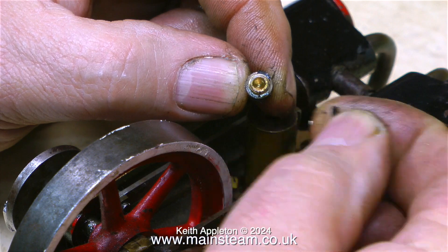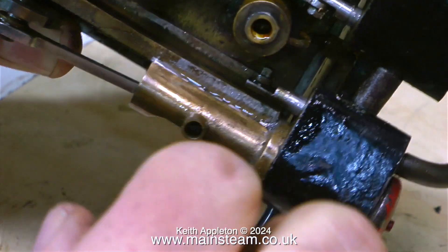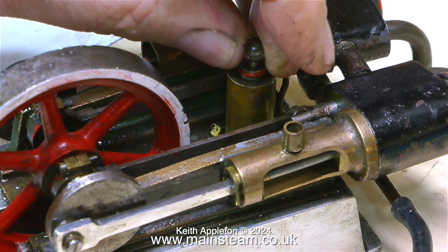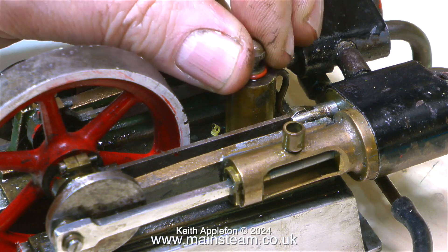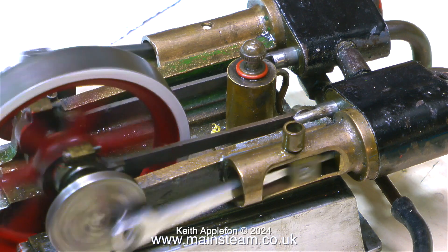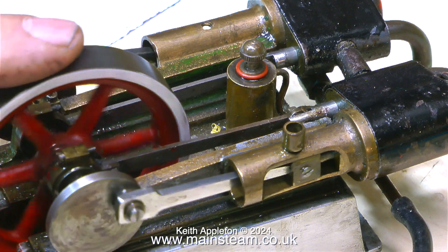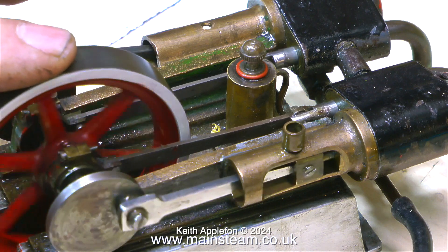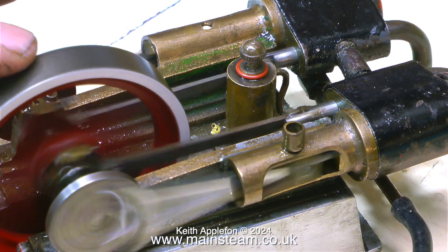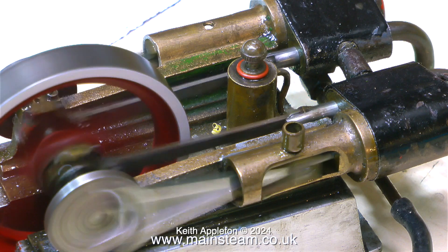This is the top plug of the displacement lubricator and there's nothing much left of the washer. It really is a very old engine — I turned it upside down and drained some water out and some very old-looking oil. In place of the fibre washer that crumbled to nothing I've fitted an O-ring temporarily. You can clearly see here that there's nothing leaking from the piston valves. The only leak I can see is on the cylinder nearest to the camera where the crosshead guide fits to the cylinder itself — I'll look into this in greater detail later. When I look closely at the engine I can see it used to be painted green, but I won't start talking about painting it just yet.